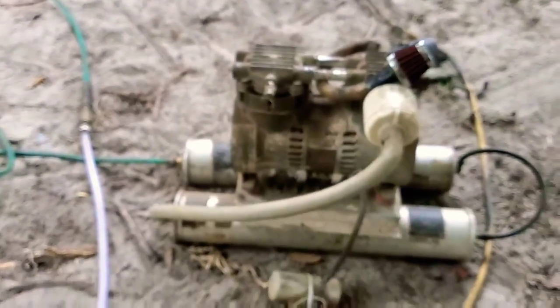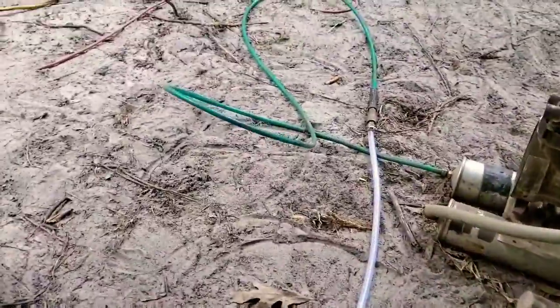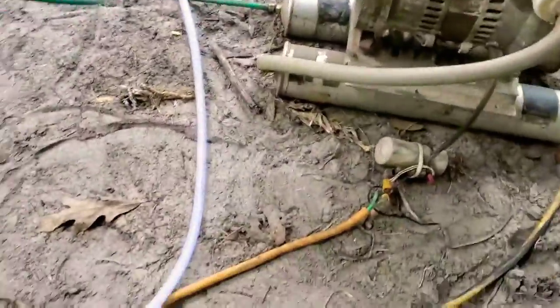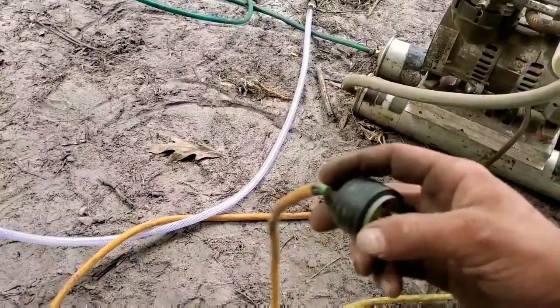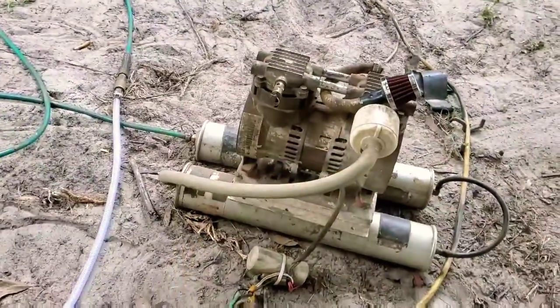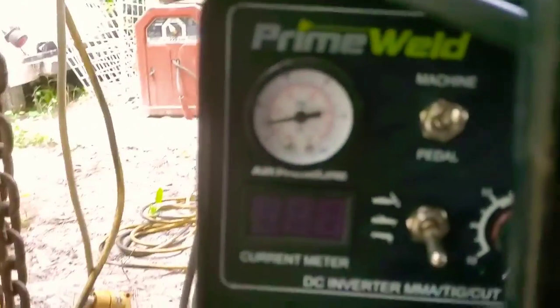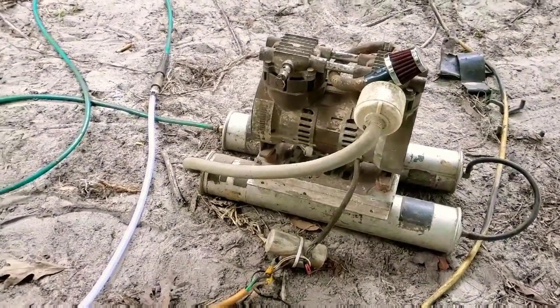I actually have a leak in the system on purpose, so that way it doesn't build up too much pressure and overpressurize my machine. I have a little switch that I put on the end here that you just plug into the end of it and then plug that into the plug — it has a switch where you can turn it on and off. But it's really quiet — you don't hardly even hear it. And it builds up the pressure almost immediately. But you see the pressure dropped off as soon as I unplugged it, because it's got a leak in the system — I did that on purpose so it doesn't overpressurize my machine, because that could damage my plasma cutter.